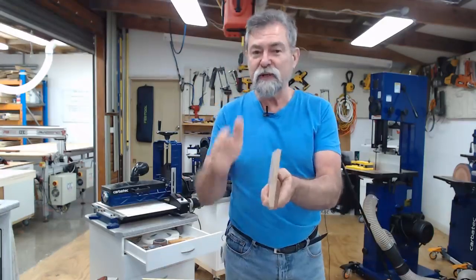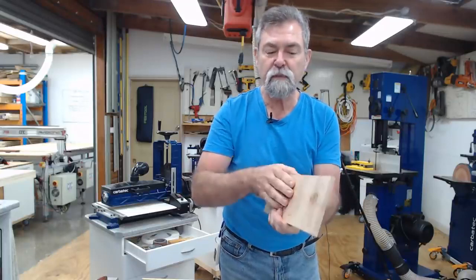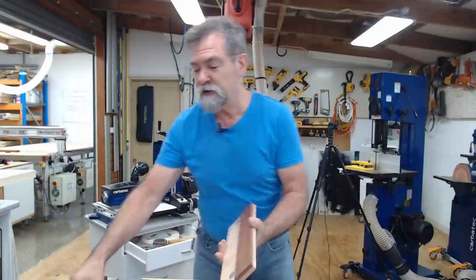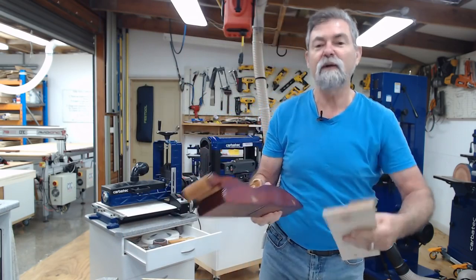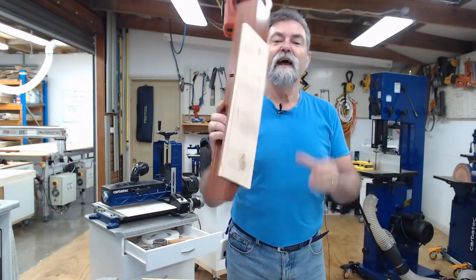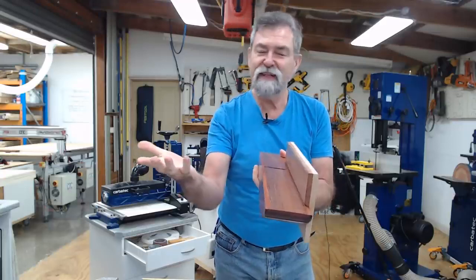Now, because the rings are going that direction, where the timber isn't laminated, see, I've got the red gum here, laminated onto the rock maple. Above it, that part's fine, but above it, it's got this massive cup. So instead of going onto the side of my plane, which it works. Where are we? Wrong way up, idiot. Turn it around the right way. It locked on beautifully. It's not going anywhere. But instead of being 90 degrees here, I've got about 88 or 87 degrees, which is not good enough.